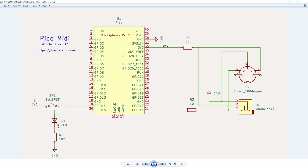One thing to note here: depending on the code we're going to be covering, and depending on the wiring, we might wire this either to ground or to 3.3 volts, which is our high value. That depends on the situation. Using an LED is fairly simple. We won't be using the LED that the Pico already has built in, because that would be too easy. In reality, you want to show something on the enclosure, and you can't really do that with the built-in one without some fancy stuff.